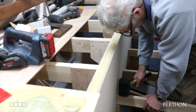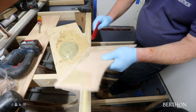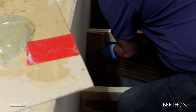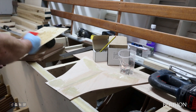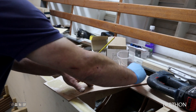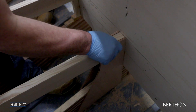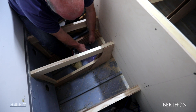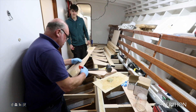Here Mike is marking and cutting the new floor bearers so that the new biscuits can be installed. These biscuits are glued and screwed together using the same resorcinol glue used to glue the frames to the hull. Using the biscuits adds strength to the structure and prevents anything from moving or shifting, whilst also tying the floor bearers to the frames.